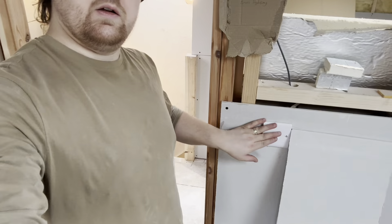They are the normal size — 2.4 meters by 1.2 meters. Unfortunately, every single plasterboard that I've put up in the rooms now has to come down. I jumped the gun a little bit and thought it was only the ceiling that needed to be done with the fireproof board — it's every interior room except for the landing. So all these boards that are up, you can see they all have their sockets all plugged in, so everything's going to have to come out. All the work the electrician did is going to have to come out.